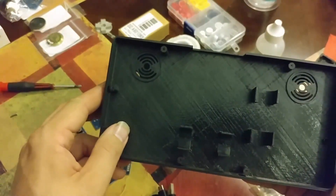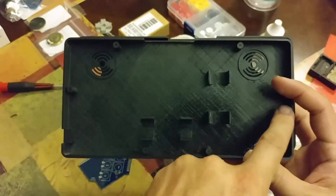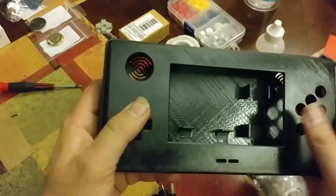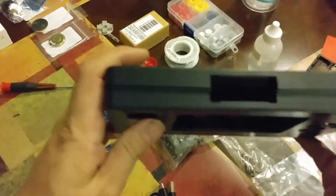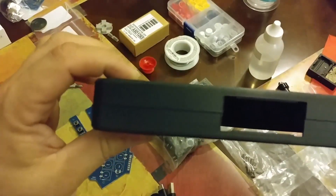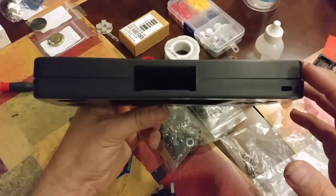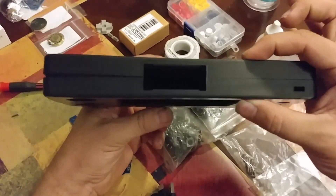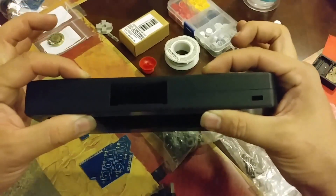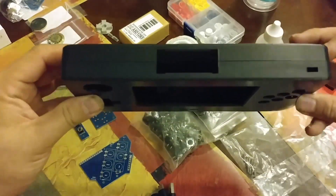Same thing for this one. When I did this one in ABS, I actually had to add in this point and this point over here because the edges were curling up. If you hold it tight like this it looks alright, but if you pinch it just in the middle, see how it's nice and raised in the corners? The previous two points were there and there was still a gap on the sides. So now we've got the nice pinch points here.